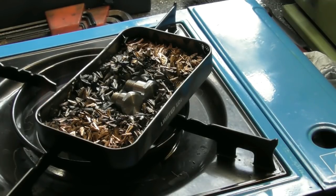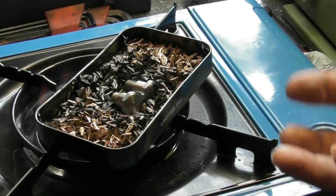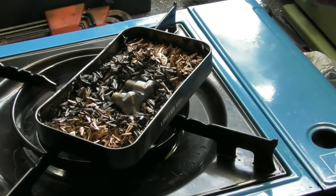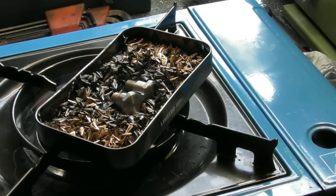I'm trying a bit of heat bluing on the three pins. I've tried the first one and had some success — I think it was more heat purpling. It's all in the timing. I've got a tin on basically a camping stove in the shed, full of brass chippings to try to even out the temperature so it's spread around a bit more. What happens is the shiny surface of the pins goes a pale straw colour first and gradually darkens to a dark straw, then moves through a bluey-purple stage, and you see various regions of perfectly blue finish.